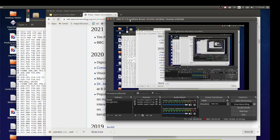So think about it: I've got a little cylinder that's pressing. If you have fluid at 3,000 psi, every square inch is pushing with 3,000 pounds. That is significant. An entire 5-inch cylinder, using pi r squared, turns out to be about 20 tons altogether, so 40,000 or so pounds, because of that much surface area of fluid pressing up. The force is there, and with very subtle signals and just lines of code, we control that amount of force very simply with a microcontroller.